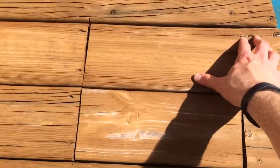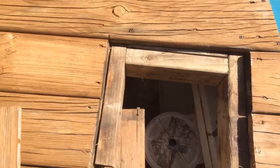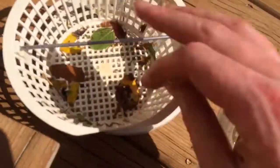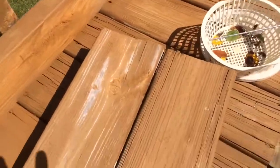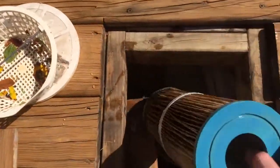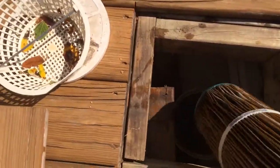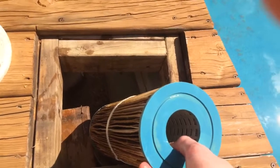The next thing you'll have to do at least once a week is access and clean out the filters. You can easily remove that cover. There's a hole on top that also allows water to escape if the water gets too high around the pool. There are two items inside: a basket strainer that catches big items like leaves, and down below is a filter with a finer grain. You'll see some green stuff on it — that shows the filter is doing its job.